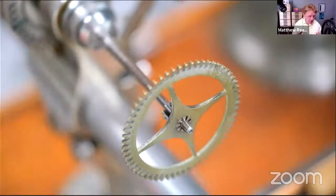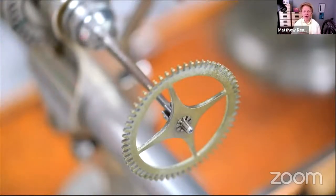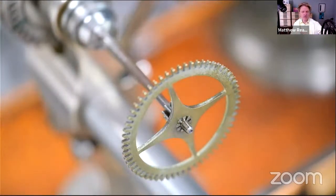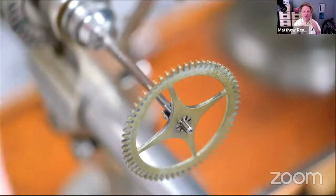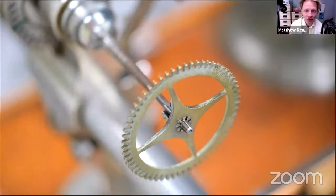Now, what I've been doing, I started drilling. So I made a drill, it went blunt. I re-hardened it and didn't temper it back. And so obviously the problem with that is a bit like carbide. It's great as long as it's great, but the harder the drill is, the more chance, and the thinner and the sharper, as in the pointier, the more chance there is of breaking off. So you're kind of always running a balance, a compromise between those things.